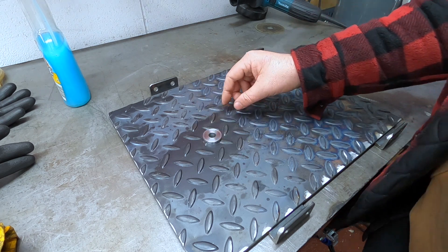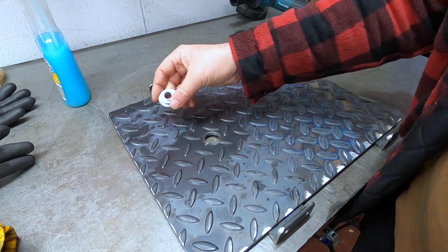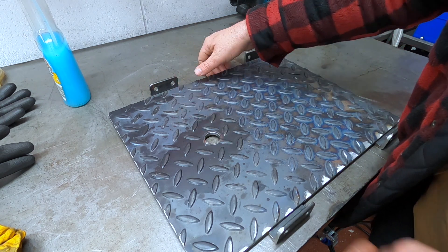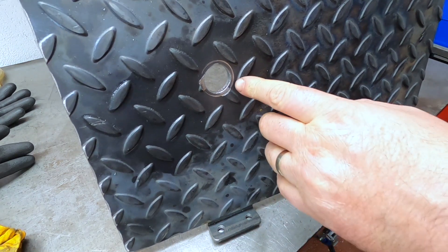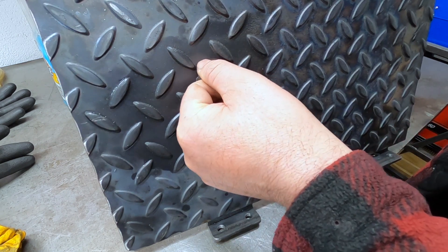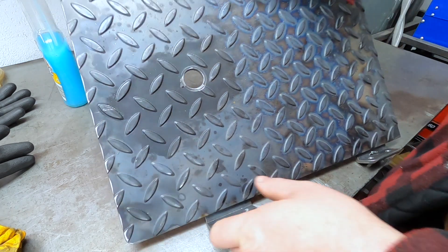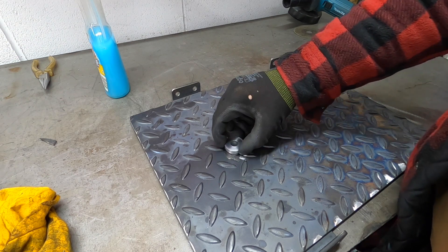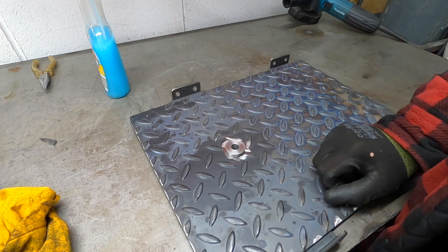As you can see it's got the play, and you can clearly see once it's pressed on it's not going to touch the floor. Right, so I'm going to put this boss in now — it sits in there. I've decided I'm going to TIG weld this. Just where this circle is — hopefully that comes up on the camera — I just need to clean the black away from the edge of that circle so that we get a good, neat weld. Just clean the black off so we can get that boss in. We'll get it tacked in and then I'll get it welded.